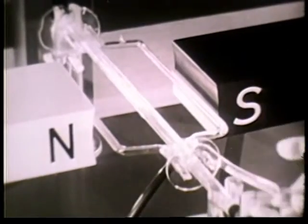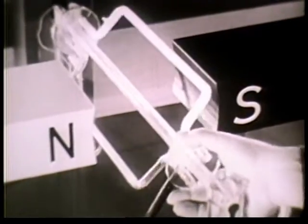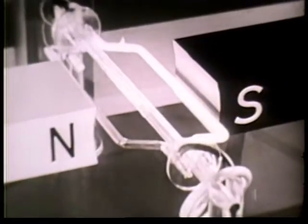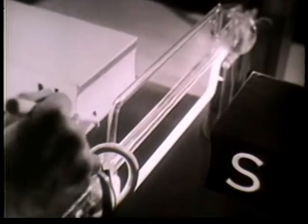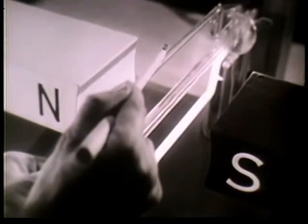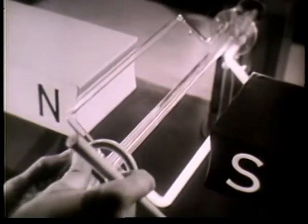This is going to be the north pole of the loop as soon as current begins to flow. When we place the north pole of the wire loop near the north pole of the bar magnet and turn on the current, the loop starts to rotate because its north pole is repelled by the north pole of the bar magnet. At the same time, similar repulsion is taking place at the south poles. Actually, the repulsion of the poles ceases at this point and the attraction begins. The south pole of the magnet attracts the north pole of the loop and the south pole of the loop attracts the north pole of the magnet. And so the loop's north side continues to move in order to get as close as possible to its objective. Just before becoming aligned, the current through the loop is cut off.